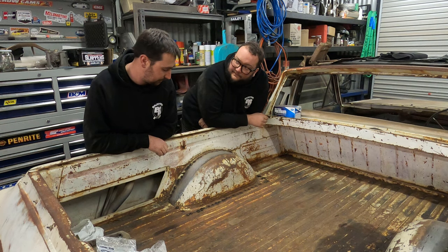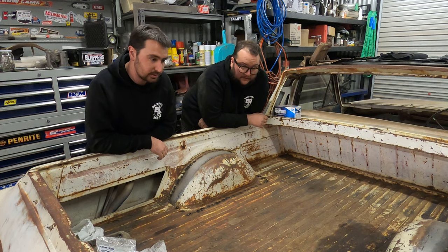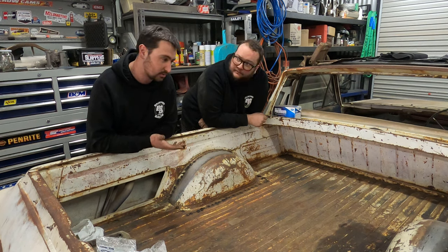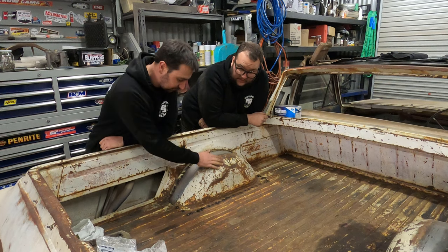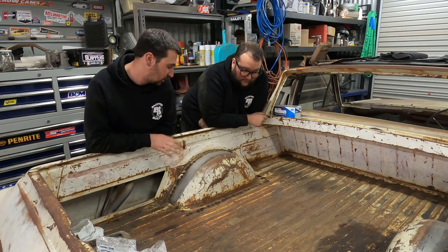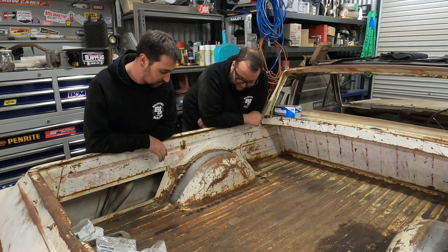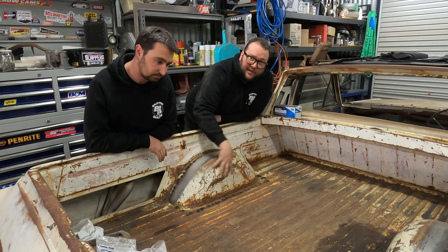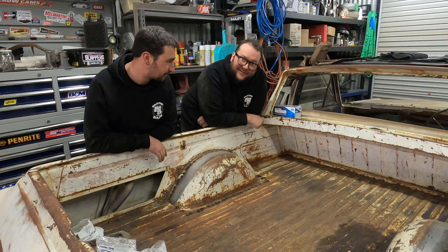But yeah, as you saw, we TIG welded it up, dressed it out, sanded it. We've left it rough on purpose. As much as we wanted to have it nice and smooth so you could see it, we actually don't mind it being a bit rough. Sort of adds to the dings and the dents like it would have had as a ute. We'll probably fake the colour on it, or we might just leave it. We'll get all that welded in properly and smoothed off so you won't see it. The top will just start to blend in and start to rust and look as it is, really. Bit of red oxide, bit of bone coloured paint, and be good as gold. Try and get a colour match rattle can for it. See how this goes.